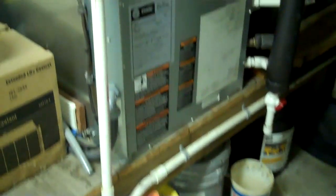This is my heat pump and it may kick on any time, so I'll try to get through some of this before it gets noisy. Basically this insulated line here — the water goes in and then it comes out and discharges into the canal, or it waters the garden and the lawn. The two copper lines are for what's called a de-superheater which heats 80 gallons of water. I can heat all my water just by running my heat and air conditioning.